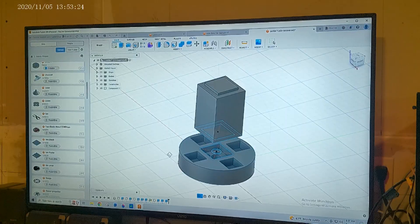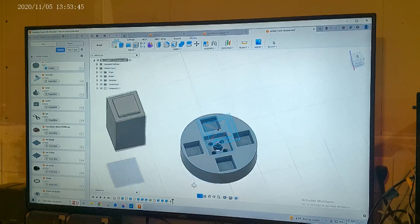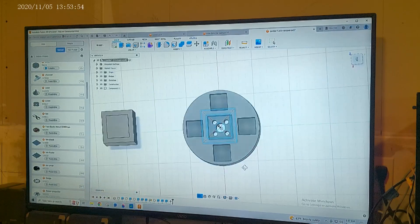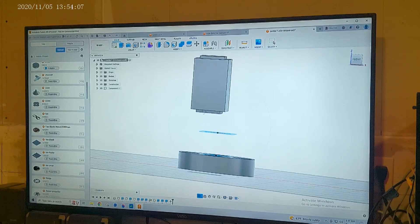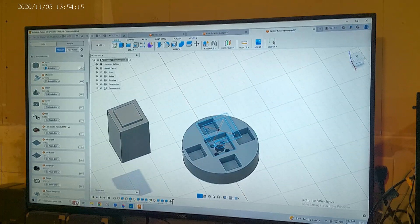This right here is our motor core — both parts. That would be labeled separately in the STL files. All it is is basically the room for the magnets — as you probably have seen already, we got those in there and they're pretty tight. You have to build out for your motor here, and in the center you see the hole so that that little post can come on through. The other part here you can see has the little tabs on each side so that it sits right inside in the center. They're built together and built to fit. Sometimes you might have to take a little sandpaper on them and touch them up just a little bit to get them to slide in — you don't want them loose.